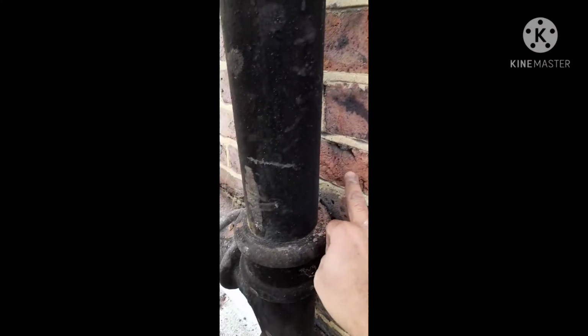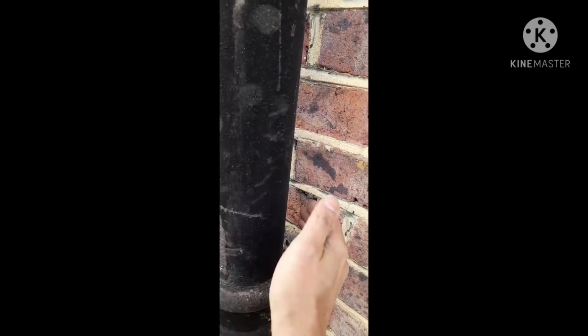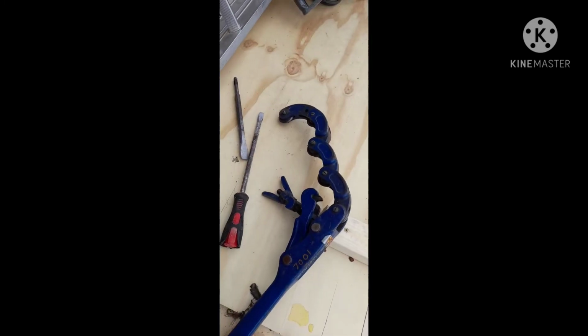For the second cut, which needs to be made here where the mark is, we still need to slightly chase into the brick so the cutter can pass through easily, because at the moment the space is not so great, and the cutter being a bit chunky, it won't pass through the space. So what we'll do is not too much, as we can see here we did. We chase slightly into the brick so the cutter can go around and swivel easily.